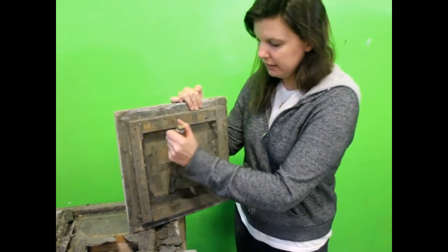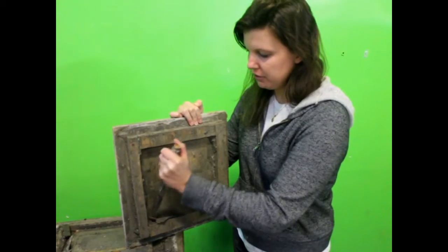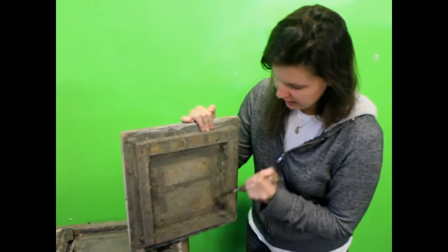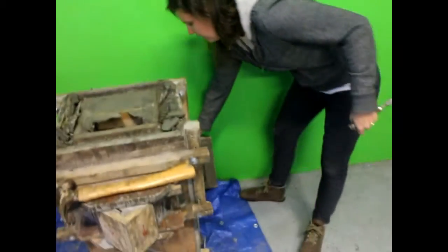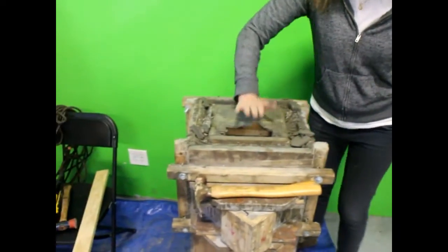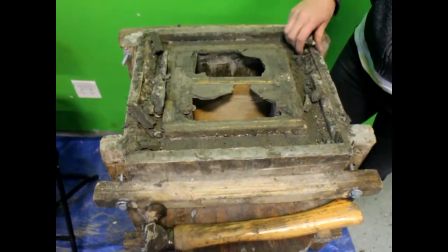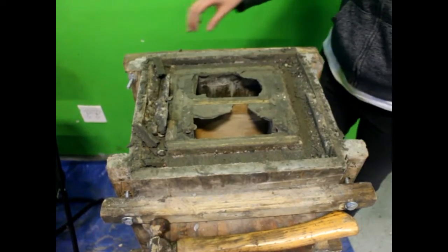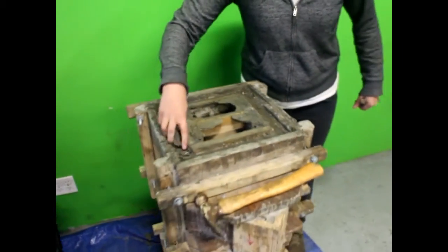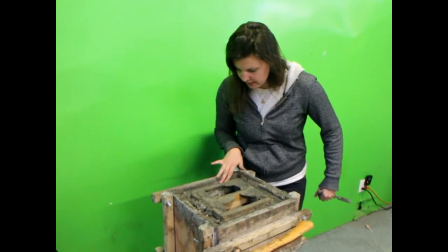You can see there's some concrete in here, so you can clear that away. What I'll do at the very end is clean every piece off with a wire brush, because you just want to make sure there isn't a ton of excess concrete. I'm going to put that to the side and break away some of this extra concrete. Remember yesterday our mix was a bit wet towards the end — you can kind of see that in here.